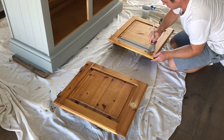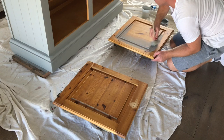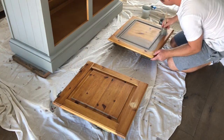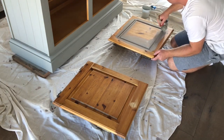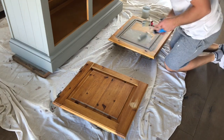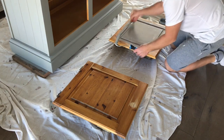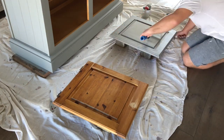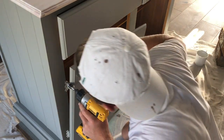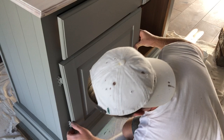When painting the cupboard doors, I just take a large round oval brush and work the paint down into the low spots of the cupboard door, then chase behind with my fibre roller to give a nice brushstroke-free finish. Now that the cupboard doors and the sideboard have both had two coats, I'm just screwing the doors back on.